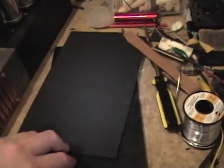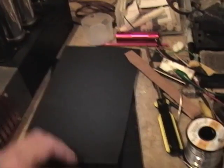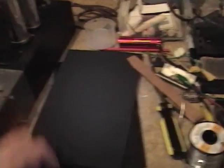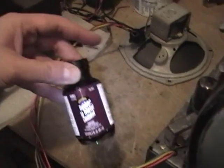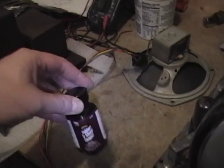The mounts are stripped down here, and there are some underneath this band up here. What I used was some rubber sheeting I got off of eBay — the thick sticky stuff at the bottom and the thinner stuff at the top. I cut it out with a utility knife and then used a little bit of rubber-to-metal cement to hold it in place. This is kind of like contact cement, and most importantly it's working fairly well — not perfect, but pretty darn good.